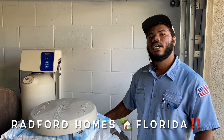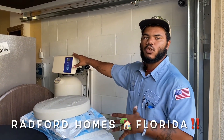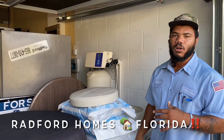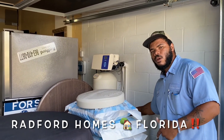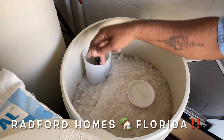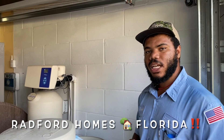During the second phase of the cycle — which corresponds to about the third phase of the actual unit cycle — it draws in the salt water that's inside this tank down here. There's about a foot of water in there at all times. Once it gets drawn up through this brine well right here, inside of here is a float mechanism — that's what this is right here. As it's sucking the salt water from down in here into here, it's making contact with that resin.